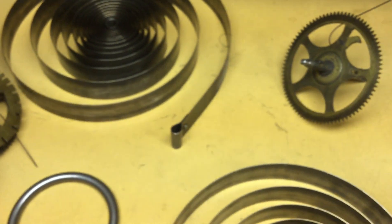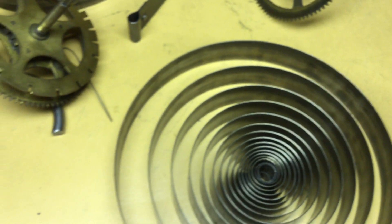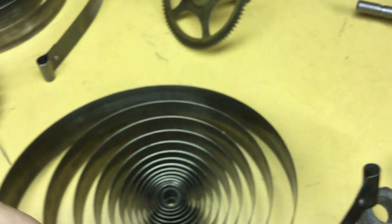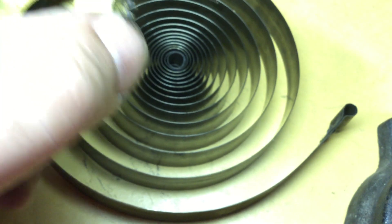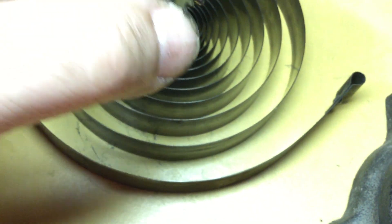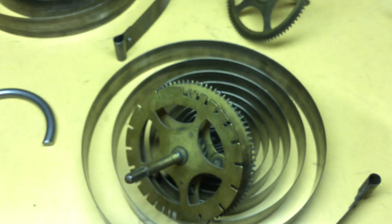So these parts now go in the cleaning solution to get nice and clean. The springs will get inspected and checked for cracks, rust, or anything. If they are acceptable they'll get reused; if not, either I'll have to try to fix the defects or replace them. Thanks for following along — the next part we should be taking a look at repairing the center arbor friction. This is Oklahoma Bridges — thanks for watching.